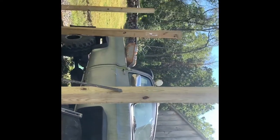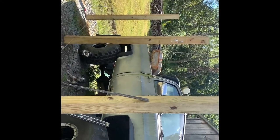So we're going to mark each one of these posts, finished floor, FF, and then we're going to start on the barn side, and we're going to go below the trusses and figure out where we want our slope. And we're not doing that with a speed square. You can, you should, but we're just going to kind of eye it up with our 4/12 pitch here off our truss and get about close to the same one for the lean-to.